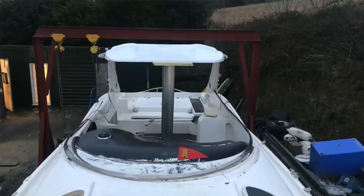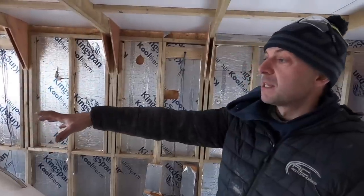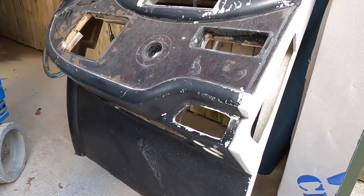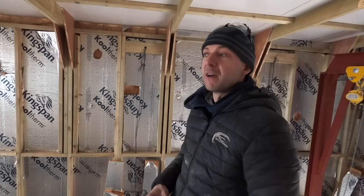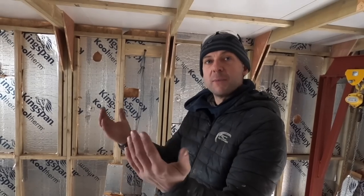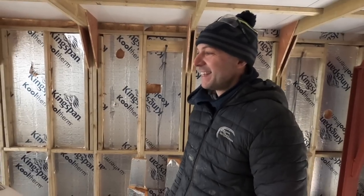The arch stanchions are still on so we can mock up the t-top to see what it looks like. The helm is now missing — it's next in for major surgery. Historically it had round needle gauges and small instrumentation, but because we're going for a glass cockpit with 16-inch screens, it doesn't fit at all in the old concept. So we're making a new mold to sit over the top of the existing one to house the glass cockpit.